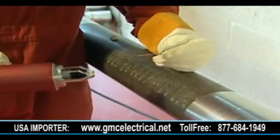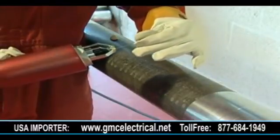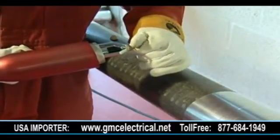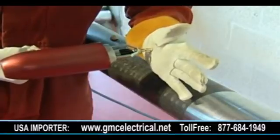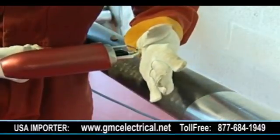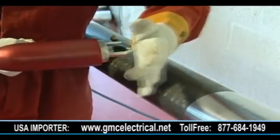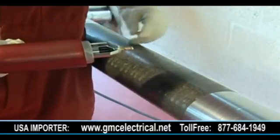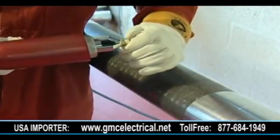Carefully insert a brazing pin which should have a straight fuse wire with the kinked end still intact, as this will gain optimum contact with the contact nipple inside the gun. Make sure the fuse wire does not get jammed and push it hard and fully into the pin holder — this must be a very tight fit. If the pin is not a tight fit, the jaws of the pin holder may have become flared and will require adjustment.